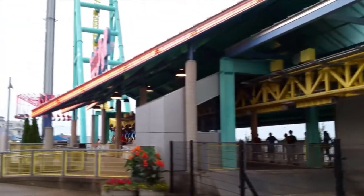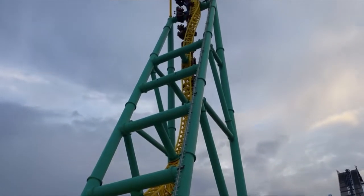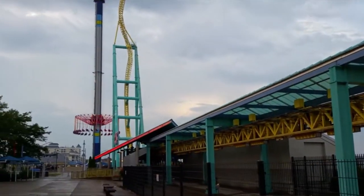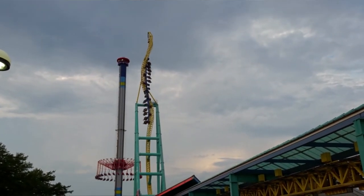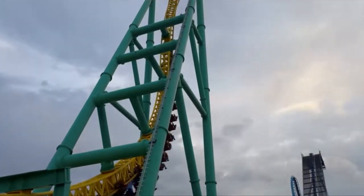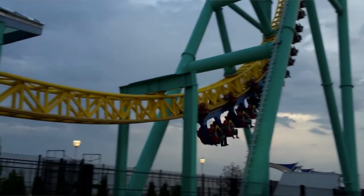Now, the current that we dump into the stators with the frequency versus what the train is actually doing, that's your drive loss. Now, it's something that's not normally thrown around. It's not really talked about. But I'm saying that you could be telling that ride to put 120 hertz at 5,000 amps down those motors. And if the train doesn't go anywhere, that's 100% loss, right?